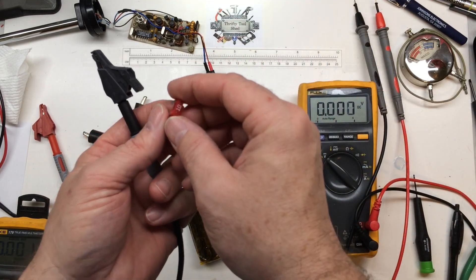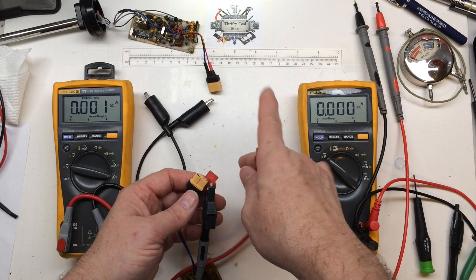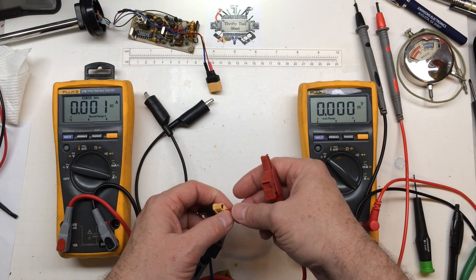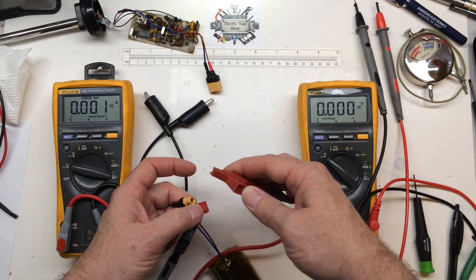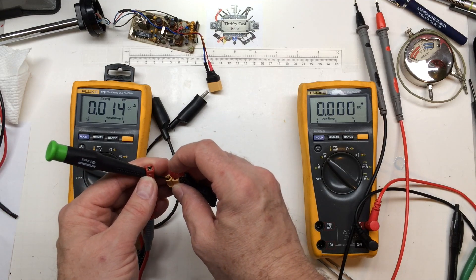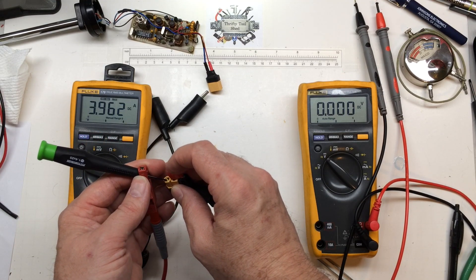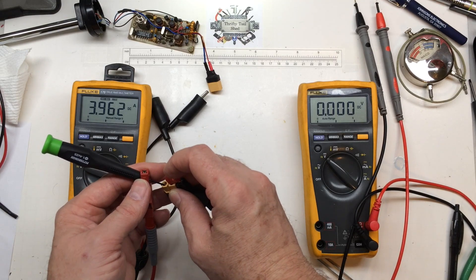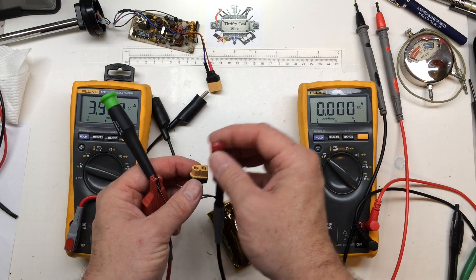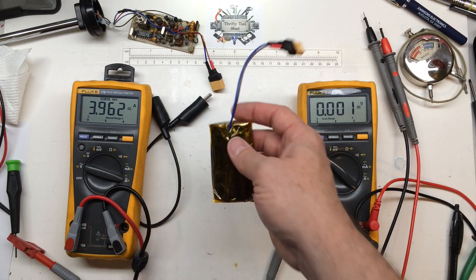I'm going to bring over a small 10-amp fuse. Since I have the 10-amp protection, I'll bring in my meter and set it to 10-amp mode so we can make sure the current doesn't go crazy high. I think this board is rated for 5-amp output — we'll never need it that high, so the short-circuit limit is probably less than 5 amps. It's a crude setup, but let's see what our current will go up to. It kills it pretty quick — around 3.9, less than 4 amps — and the output comes right back on. Very good. 8.17 volts. Very happy with the short-circuit protection.